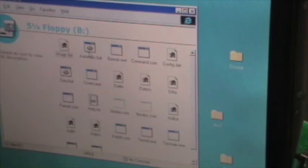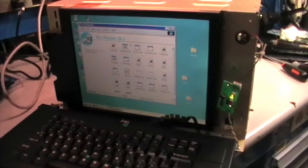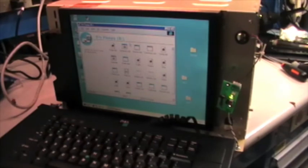I think now I really need to fix the Dolch computer, since I'm having several additional issues that I have discovered meanwhile. Number one is the hard disk drive that during the seeking is making a very nasty noise, and I believe it is the support of the head, perhaps the bearings of the heads that are a bit hard to turn, as all the other disk drives were with dried grease.